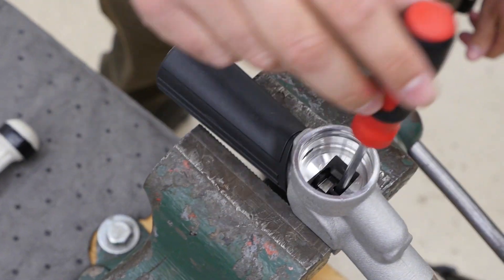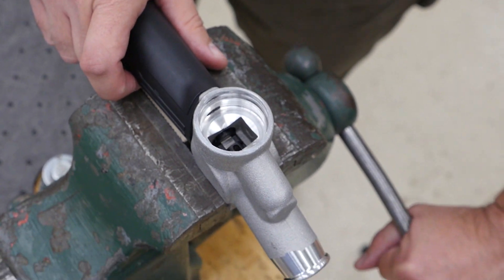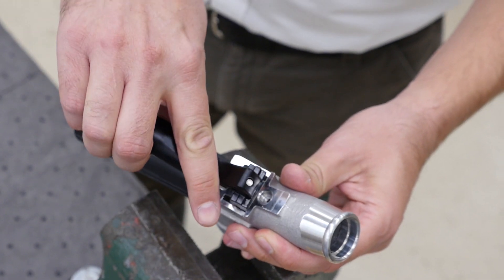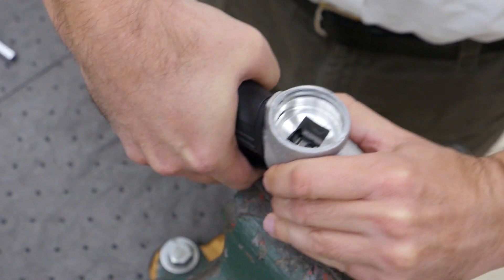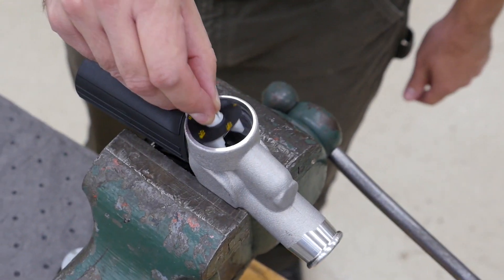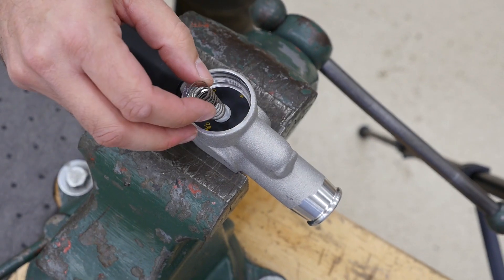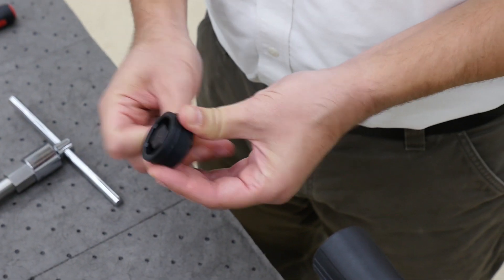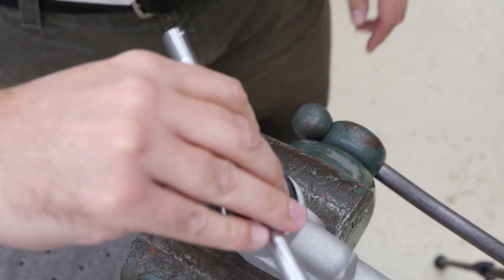Use a small screwdriver to ensure that the stem is properly aligned. Remove the nozzle body from the vise and turn it over to install the lever assembly, pushing the post of the lever assembly gently through the seal. The post should engage the stem assembly. Place the nozzle body back in the vise and install the diaphragm assembly with the rollers orientated towards the inlet of the nozzle. Then place the vacuum spring on top of the diaphragm. Lubricate two new o-rings and install them on the vacuum cap. Tighten the vacuum cap until snug.